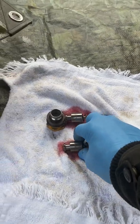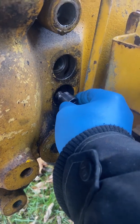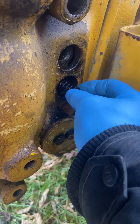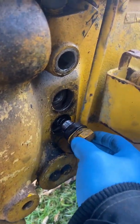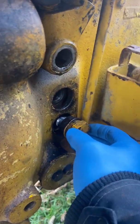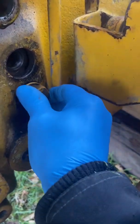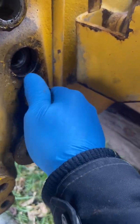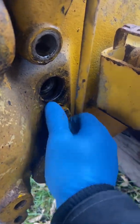We're going to install those now. This is our lower valve, and we just bring it over here and install it right in like this. I've given these a coating of oil so there shouldn't be any issues. We make sure the spring is seated and then screw it in. Good practice to put on new o-rings — that's one done.